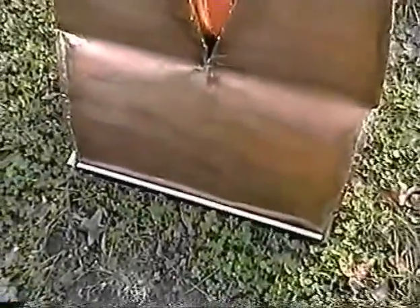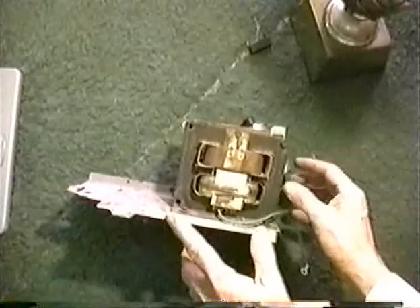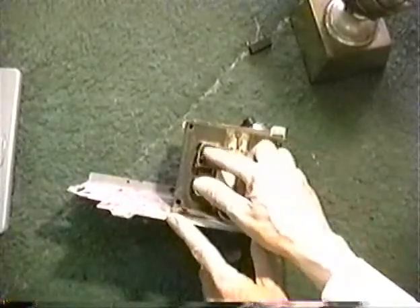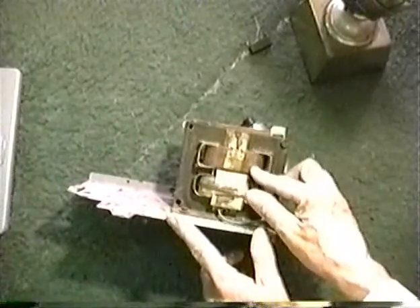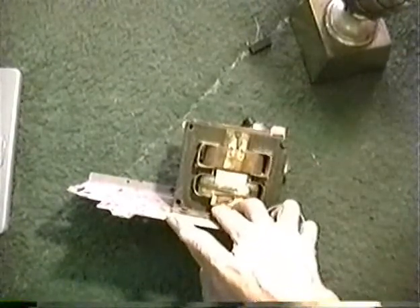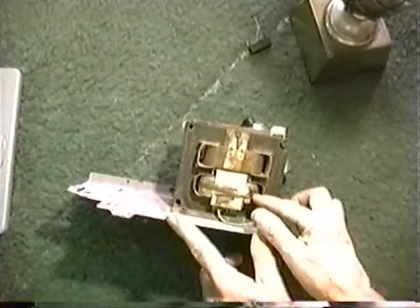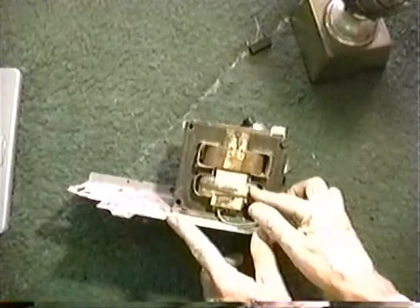The mouth of the cannon has pieces of plywood to stabilize the copper sheeting. Each magnetron will be powered by its own high voltage transformer with its 2500 or so volts of windings. One end of these windings is grounded, the other end is what we would call hot — 120 volt input windings and some windings that carry 10 amperes or so at 3 volts to the cathode heater in the magnetron.